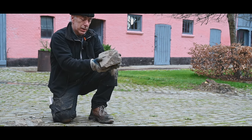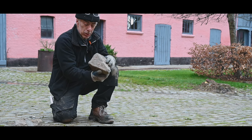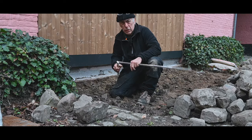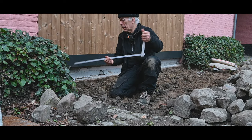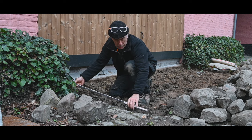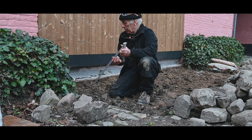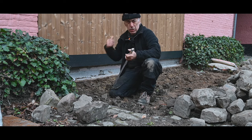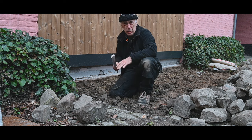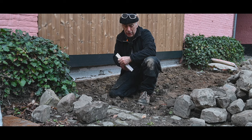I'm always surprised at how these cobblestones were actually chopped into those forms, because somebody had to do this. So first of all I'm going to create a plank on the side here so I can maintain the slope properly. This is about one meter fifty. I'm going to place a plank on this side and also on the other side, and then I will use a wire from left to right just to keep that slope in place, because I am not a professional cobblestone placer.